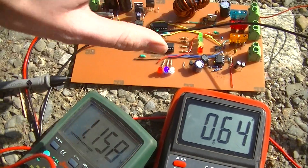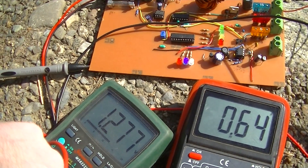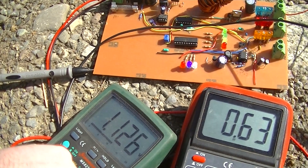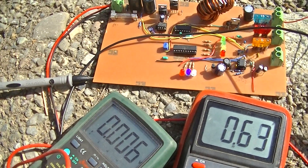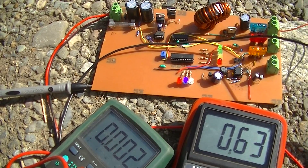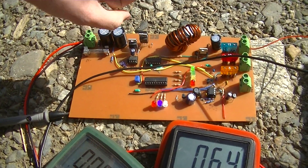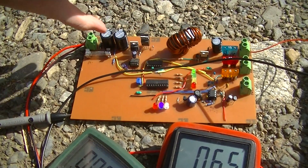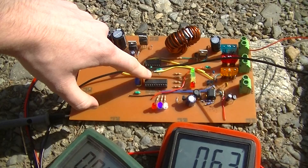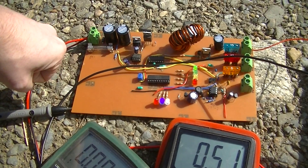Now all I'm going to do is modify the code. First I need to test the PIC16F1939 for using multiple independent PWM outputs at once, because that was an issue I had with the PIC16F883, which is what I was going to use for the multiple channel version. Then if I can get that to work, I'm just going to build a board that's three buck converters with the analog circuitry on it. The microcontroller and its associated components are going to be on a separate perf board, because carving this for a DIP20 package was not fun — and doing it for DIP40 would be, yeah.